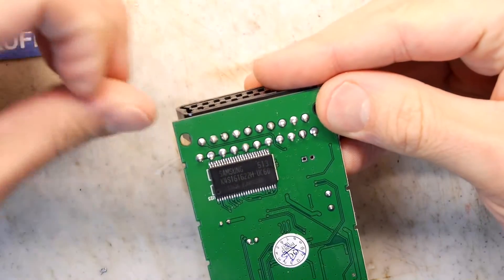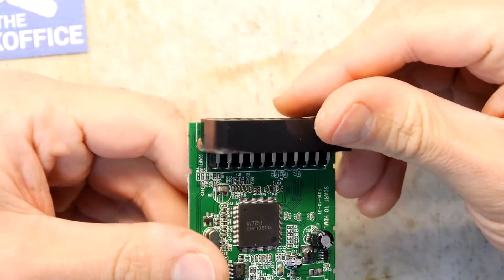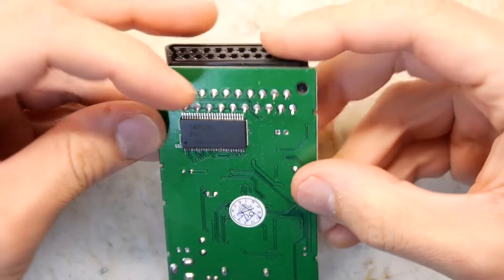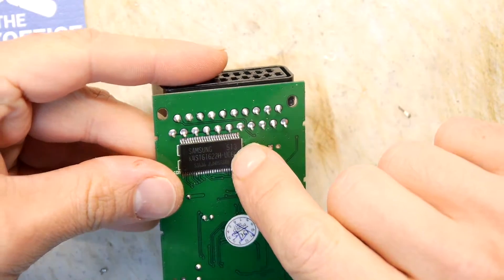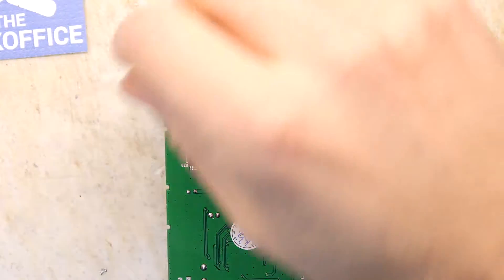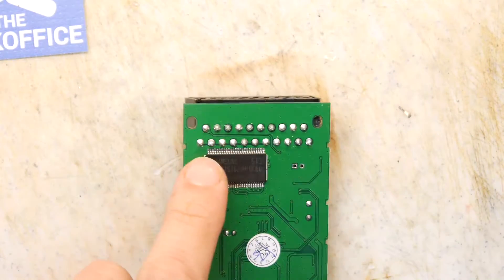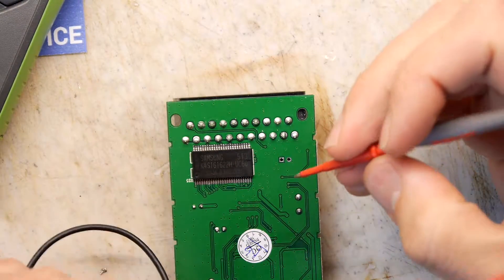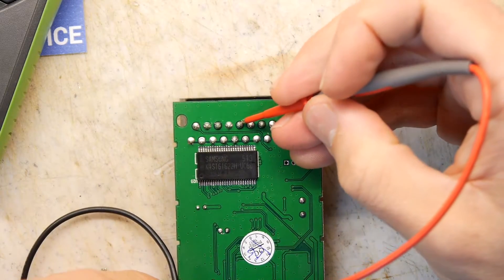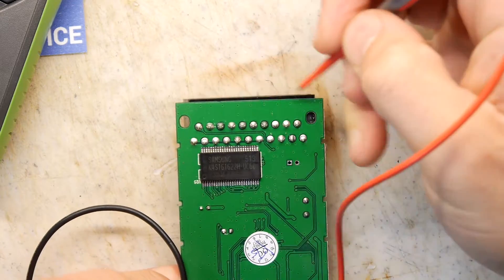There's a bit of a blobby blob of solder there — that's not too pretty. It is a double-sided PCB. I'll have to get the SCART specs out to be sure, but it does look like a number of these pins aren't actually connected. The soldering could frankly be better here. I'm going to test this out — there does seem to be a ball of solder where there really shouldn't be. I'll have a quick play to see if it was actually shorting that to ground. We'll pick a nice ground point here. Yeah, it seems we're all right.